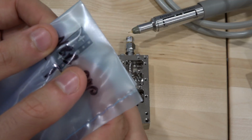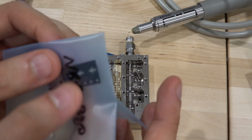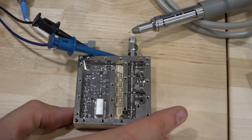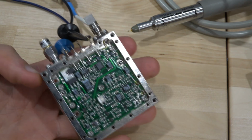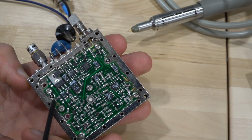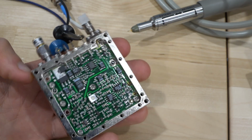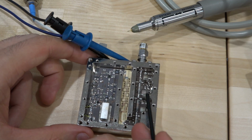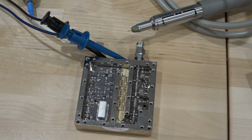They don't have a lot of gain, only 9 dB, so we might have to use more than one. Anyway, we'll see. I'm very curious to see what we can get with a brand new amplifier. Now the biasing of this is different than the bias network that's in here. If you look closely, the amplifier currently on the board is biased through a Darlington transistor here, which is connected through this port to the other side at this standoff, and from there it biases it. There's a 55 ohm resistor in series with the output, which may actually be enough. It may work just as it is with our existing circuit. So I'm going to figure that out, put it in there, do some additional measurements and see where it takes us.